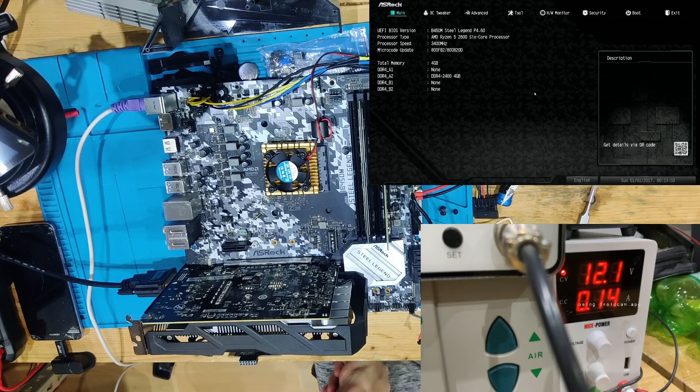All that's left is to find a spare part. I'm probably not going to find the exact MOSFET, but I have spare MOSFETs on other dead mainboards and I'll find something with a similar RDS(on) and maximum amperage rating. That will be done off-screen, then the board will be patched up and ready. Thank you very much for watching — hit the like and subscribe button, hope to see you in the next video, have a good one, bye!